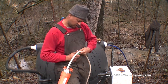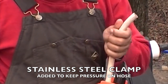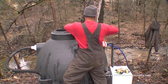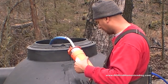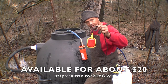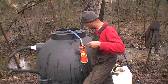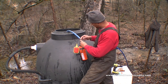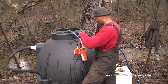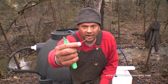I'm going to give myself some extra slack here. I'm going to go ahead and put a float valve in here, just in case I can get it to work — so that if I'm gone and this thing is pumping up to the top, when the water reaches the bottom it will turn off the pump and keep it from burning out or having any issues. I'll need to get some wire tie to keep this in place — using the original copper wire.